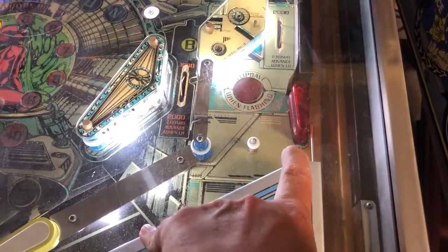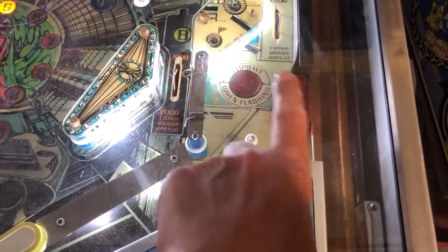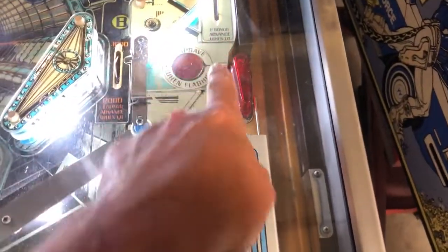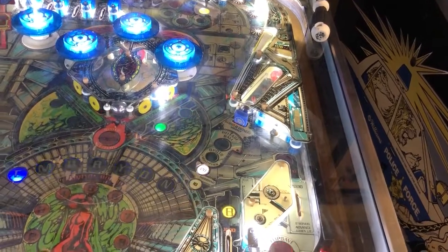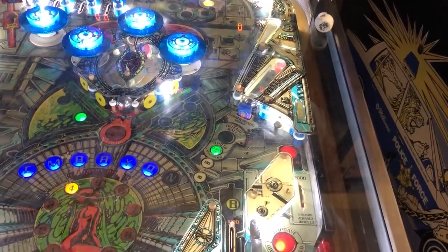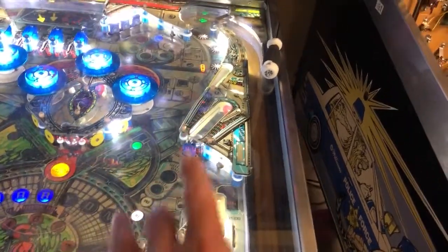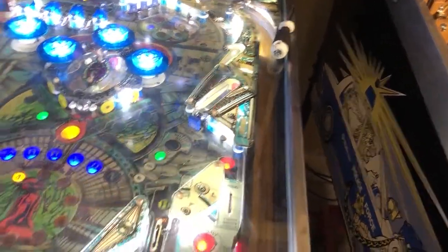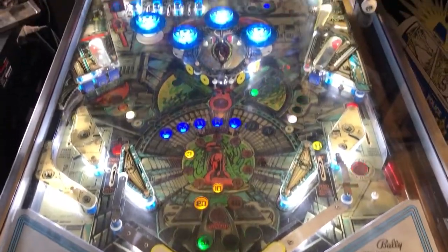There's also a flip save over here that I got a rubber for, but it's too small — whatever came from the set will not fit on there, so I need to find a different flipper rubber for that one. That flipper is only active at a certain point when a specific feature is flashing, and I believe that's when it allows it to turn on and be flippable — but it just doesn't flip, it's never done anything. The bottom flipper was working just fine, but the top flipper was shotgunning and having issues. I've never really changed end-of-stroke switches on a double set of flippers before — most games I've bought have had two flippers, three max. So right now I've got no power going to that one, and the new end-of-stroke switches I put on it didn't seem to work, so I ordered some different ones.